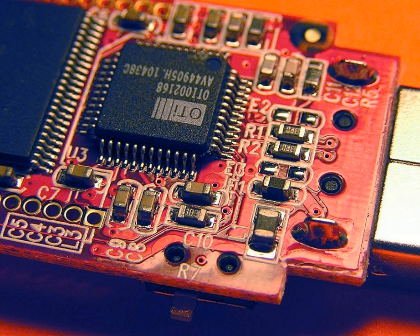Alternatively, SMT and through-hole components can be soldered on the same side of a board without adhesive if the SMT parts are first reflow soldered, then a selective solder mask is used to prevent the solder holding those parts in place from reflowing and the parts floating away during wave soldering.